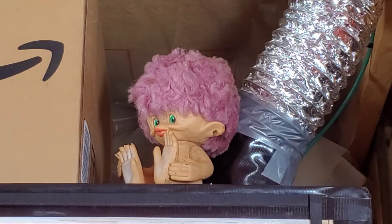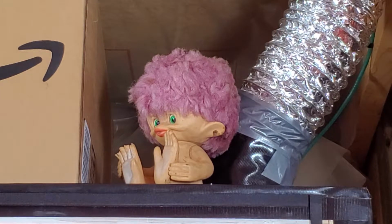I'm here today on my GROWSS website because I'm adding a moisture sensor to my system. I'm actually swapping out the density sensor for the moisture sensor because I don't have enough analog inputs to accommodate both on this hat. Everything's limited with the Raspberry Pi in terms of having enough inputs, especially if you want to go crazy. But that's the nature of the beast for all single board computers.